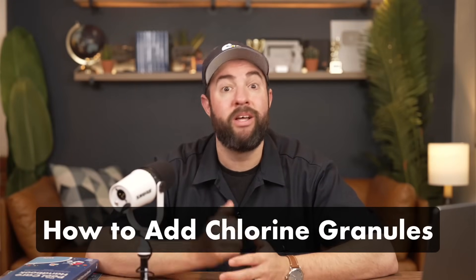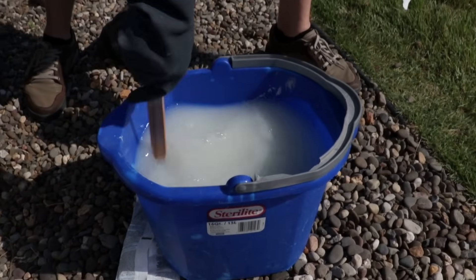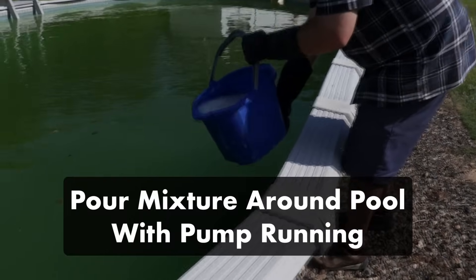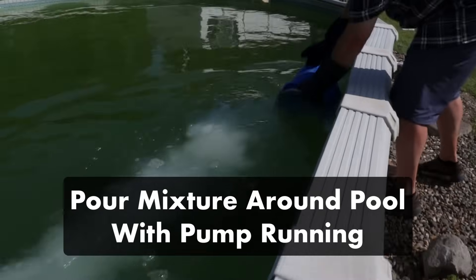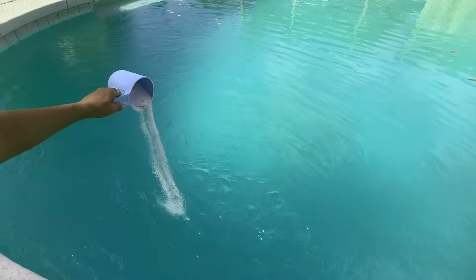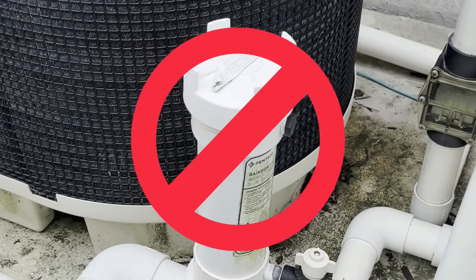Next, here's how to add chlorine granules. These are added directly to your pool water. Start by measuring your chlorine granules in a measuring cup. Some chlorine granules work best when pre-dissolved in a bucket of water — add your granules into the bucket of pool water using a wooden stick to stir it in. Then pour this mixture around the perimeter of your pool, starting in the deep end while the pump is running. Pre-mixing granules helps prevent them from settling on the bottom of your pool, but always follow the manufacturer's directions. If granules settle on the bottom, just use a pool brush to help it dissolve. And never add granules to an automatic chlorine feeder — it just dissolves way too fast.